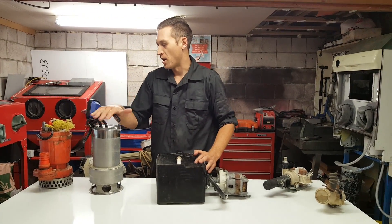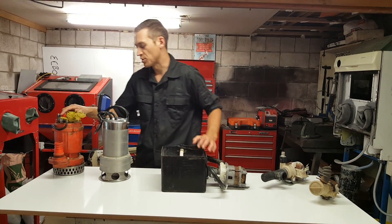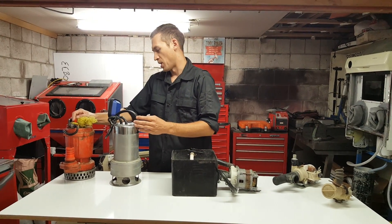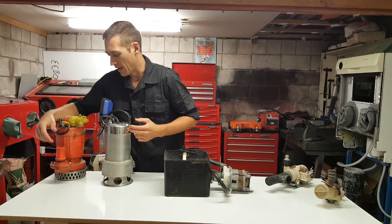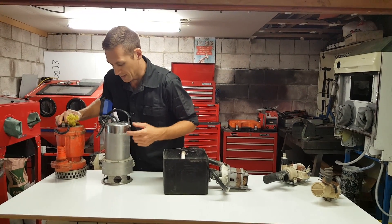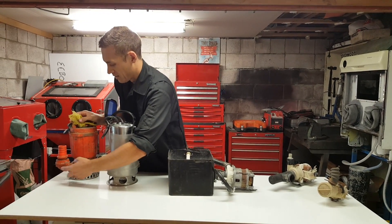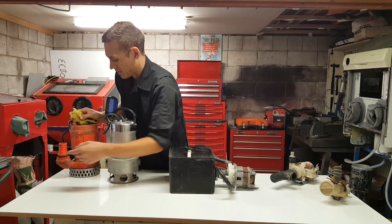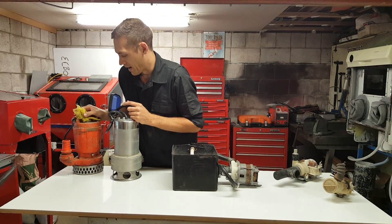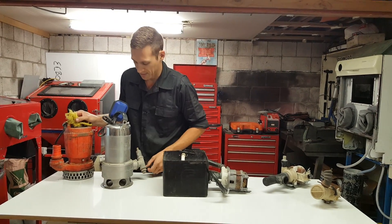Today I want to go over the setup of the pumps I'm more likely to use, which is these ones here. There are two general types — they come in all different sizes, different power ratios, and the configurations differ. These are my preferred type. As you can see on this one the outlet comes out and up, which makes the plumbing a little more difficult. If you have the option, I think the side exit ones are actually better.